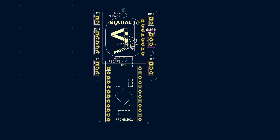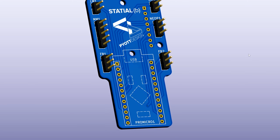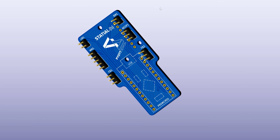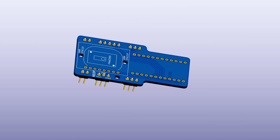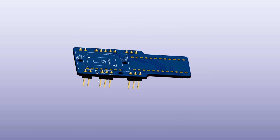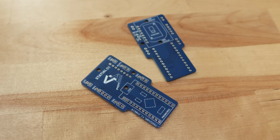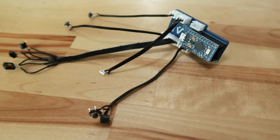If I centered both the Pro Micro and sensor over each other, their pins would hit. I couldn't put them side by side on the board because of space constraints, so I ran them vertically on the bridge board design and hoped for the best. After that, I output the Gerber files from KiCad and sent the first round PCB design off to be fabricated. My first round of PCBs came back looking great, so I soldered them up. When I plugged in the Pro Micro, the sensor came right on and everything worked.